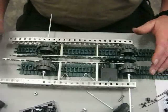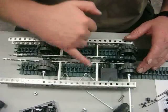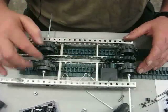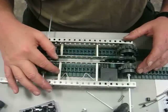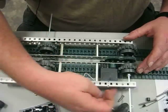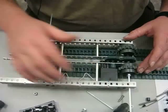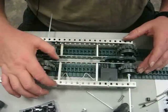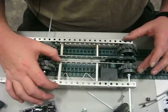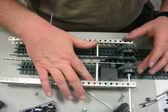I've got some options on how to narrow the C-channel down. The first is these standoffs right here are two-inch standoffs, and I can lower them down and cut them to narrow it. I could also cut the back of the C-channel out and stick the servo through there, but that's a difficult cut to make. So I think the best I can do is move the standoffs down to snug that motor right up into the C-channel.